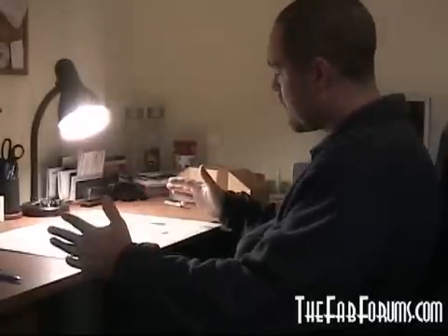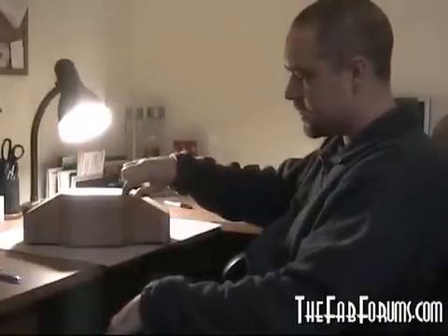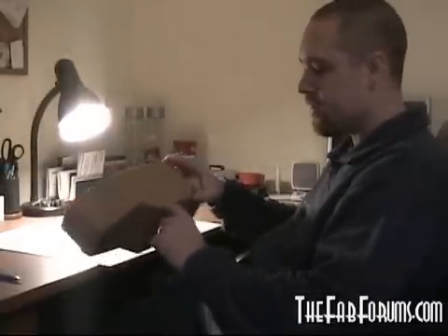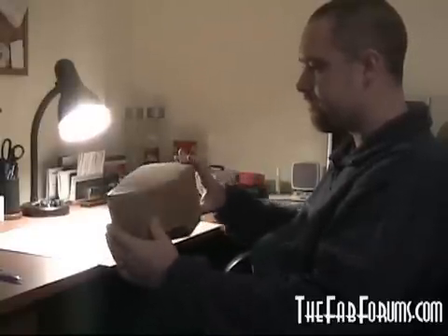The first thing we're going to do is put our design on paper or cardboard. We know the measurements, so we're going to lay it out as if you cut these seams and flattened it. Sometimes it's harder than you'd think because it's hard for your mind to think two-dimensionally. You can cut strips out and tape them together, then cut the seams and lay it out. This particular one was pretty easy because I stuck to standard angles — basically everything's done in a 45 or 30 degree.